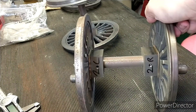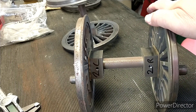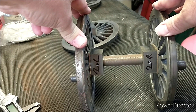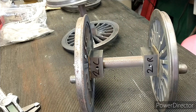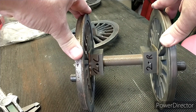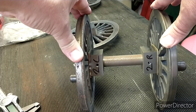That's basically what quartering is — you want about 90 degrees difference between the left and the right-hand side. The actual angle doesn't matter as much as ensuring that for each of the six wheels, or three axle pairs, the angle needs to be exactly the same. At the moment, despite the fact that they're pinned, there's actually quite a lot of slack in this particular axle.